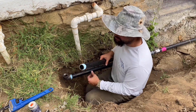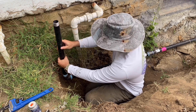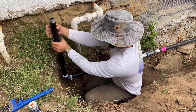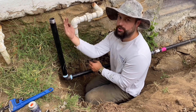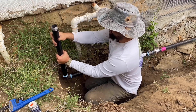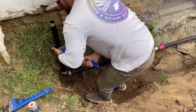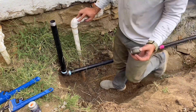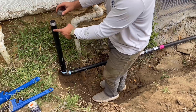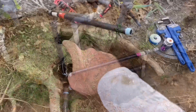I'm going to turn this 90 facing upwards. I've got the pipe dope and the tape. Now I'm going to stick this riser inside this 90 and finish tightening it to straighten it up. Now I'm going to put this cap back on so that the rain doesn't get inside and no dirt gets inside there. Here's the hole that we need to pop up through.